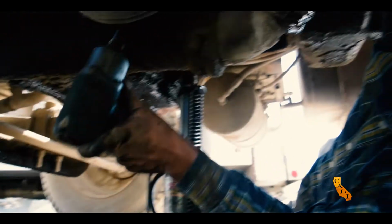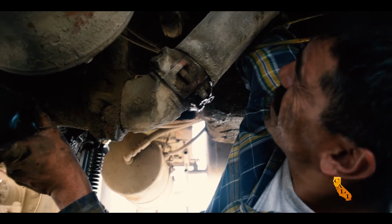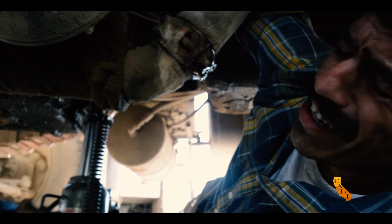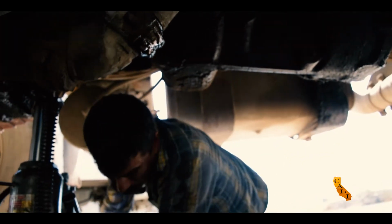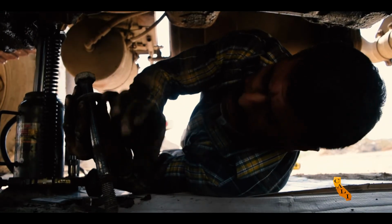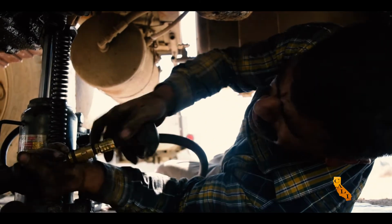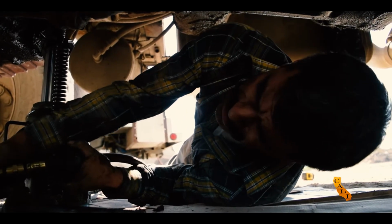It was our first nut, and it's double nutted, so we're gonna take the second nut off. This is our bolt that goes right through the center of our mounts. It's pretty much a saddle and the engine sits on it. And the engine is going almost right through that saddle. There's quite a bit of damage in there. We're gonna lift it up a little bit, lift it off that plate and make a new plate, put it in between, put a bushing between it too, and then tighten it back down. That should solve that problem.